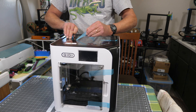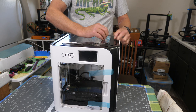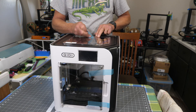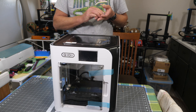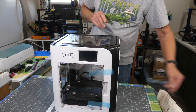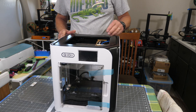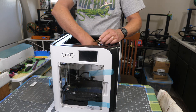The front is facing the camera right now. This cover on the top is removable - it says to remove it when using PLA or TPU. So if I'm using ABS or PETG, I'll have the cover on. It looks like there's some other unpacking to do - there's a cable tie around the print head that I'll need to cut and get off, and there's some cardboard packing in there.